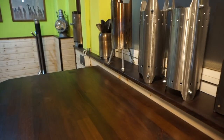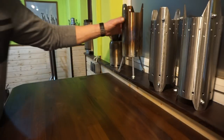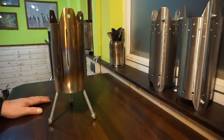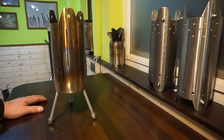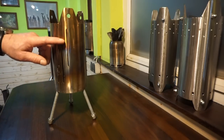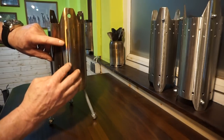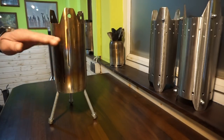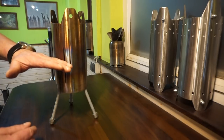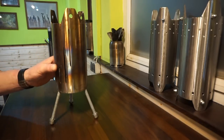The next one is colored by the heat. You know this is the simple stove with slots for air intake. If the stove is loaded with wood you have more primary air in than secondary. And if the wood burns down, the relation changes to more secondary air. It works very well.